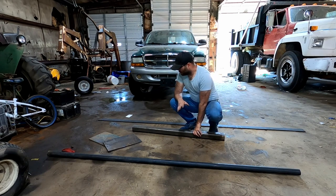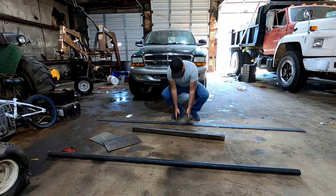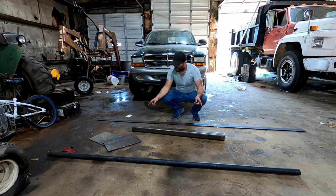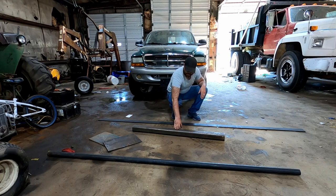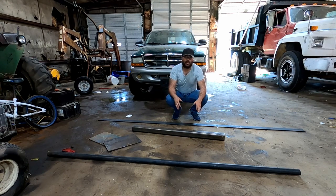What we're going to work on first is 8-inch long tines. So we're going to cut this down into 8-inch pieces. We're going to get a square and put our end caps on. This is not going to be perfect in that this is 3/8 inches, but it's 3 inches with the outside being rounded, so we're going to have to fill some weld there. That's fine.